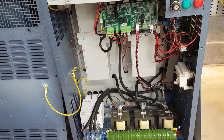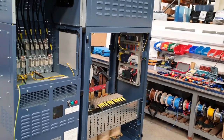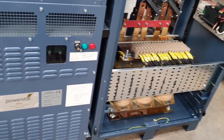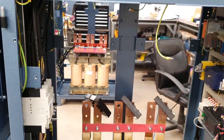All of the components at the back are linked to the main control board which can be controlled individually and decides what the system should do under certain circumstances. There is an individual power supply to enable the system to operate self-sufficiently if necessary, and it also has protection via fuses throughout. Once the completed transformers are sent from our Bromsgrove site, we assemble the electronics for our PowerStar Max voltage optimisation systems at our manufacturing facility and head office in Sheffield. The electronics are what enables the Max systems to be dynamic and they are programmed to meet the specifications of each site to ensure the optimal voltage is delivered at all times.